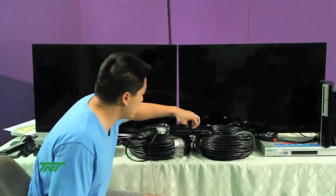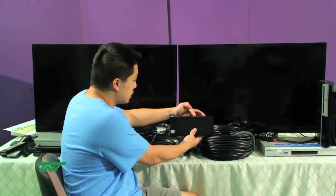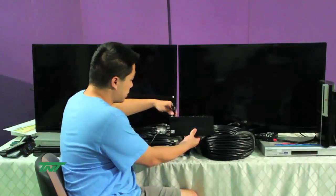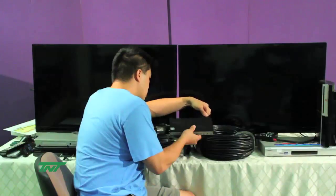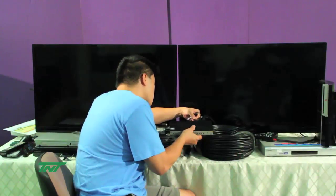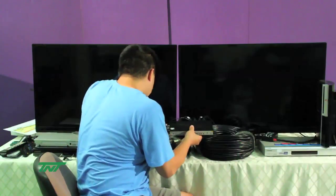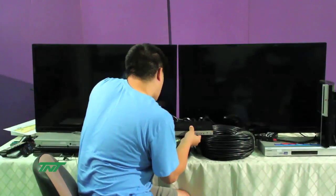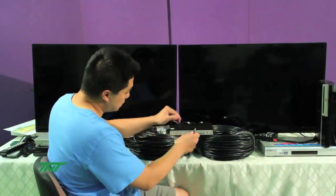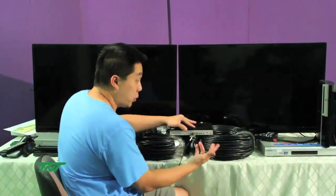For this matrix, connection-wise it's pretty simple. I'm going to turn it around — you'll notice the HDMI inputs connected to the players. I'm going to connect the HDMI cables straight right now, then connect the UTP cables. And lastly, I'll demo the IR connection right now. I already have one IR set up — it works for all four, but I'll show you only one player. Lastly, power — you plug it in and you see it lights right up.